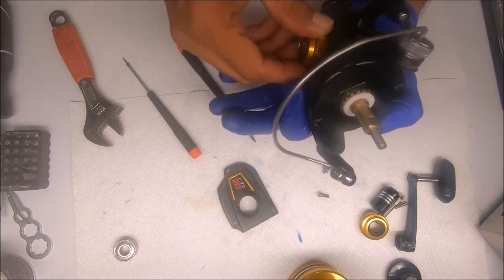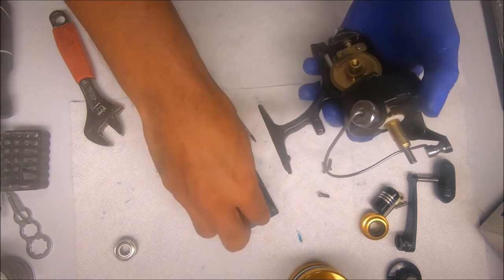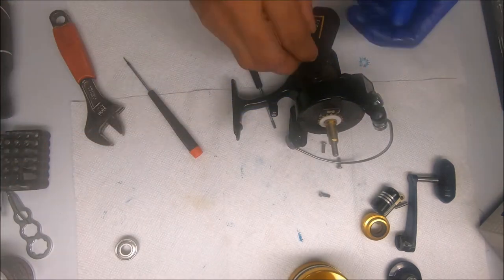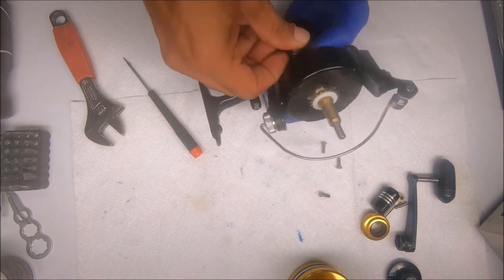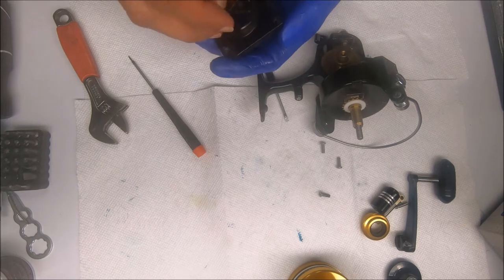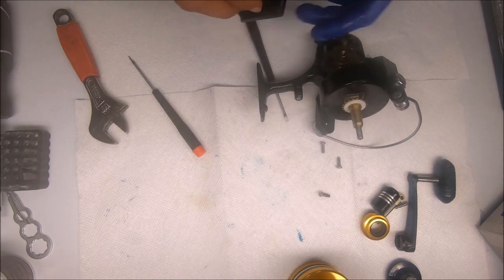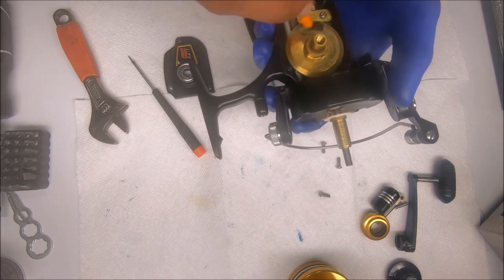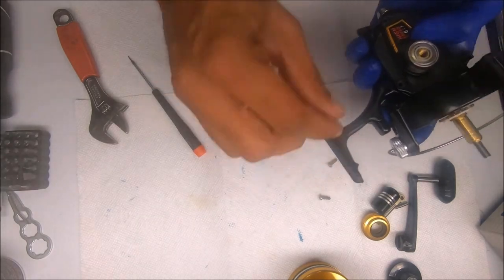That's locked down. Cover that up, get this on top. I'm going to add a little bit of grease inside here, stick that down there. Add this bearing — we will replace the bad one just for the purpose of the video. Before I close that up, I'll also grease lightly the top of this main gear. Set that down, screws in place.